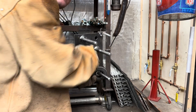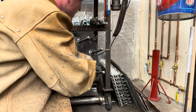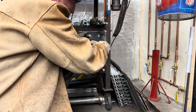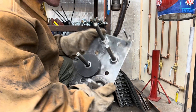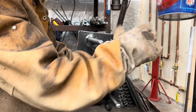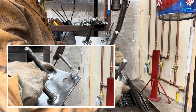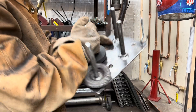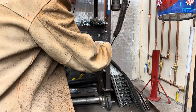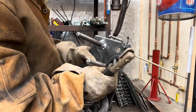Project complete! I was thinking I'd tack it right up here on my little table where I store my stuff — I'm just going to stick weld it, stick tack it. There it is. As you can see, I've welded this little hook here just for my grinding wheels and wire wheels with smaller diameter center holes — they won't fit on these pins. TIG welded all these pins, and I'm just going to stick weld it right in place here. So when I need a grinding wheel, I just reach down and grab it.